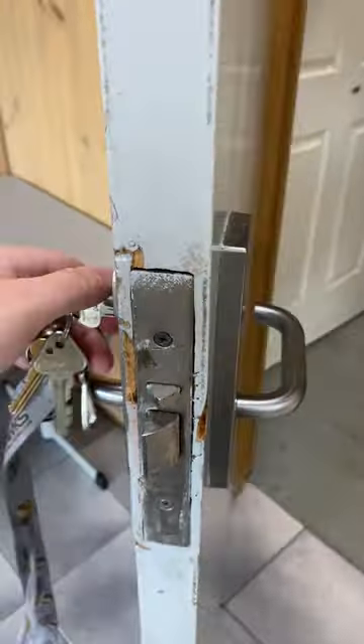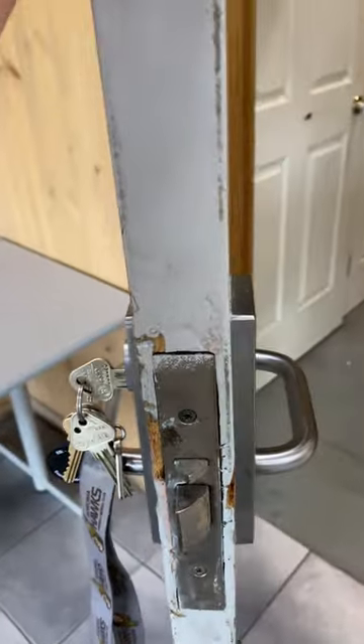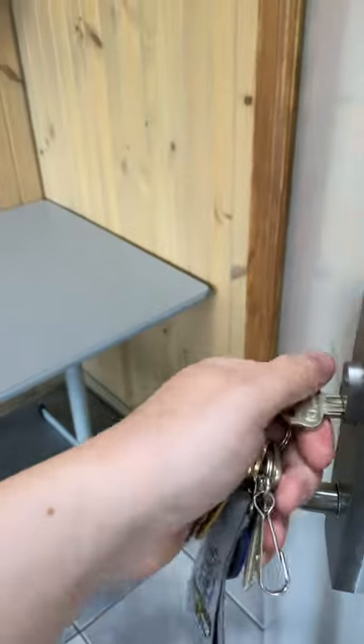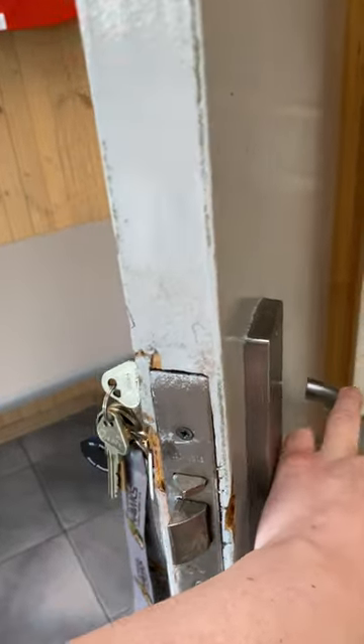The purpose of this particular lock is basically to keep people from locking it on their own. If this were a standard entrance lock, students would simply turn the snib on the inside and lock their teacher out. So you do need a key in order to lock and unlock this lock, and only the outside will be locked — the inside will always remain free to exit.